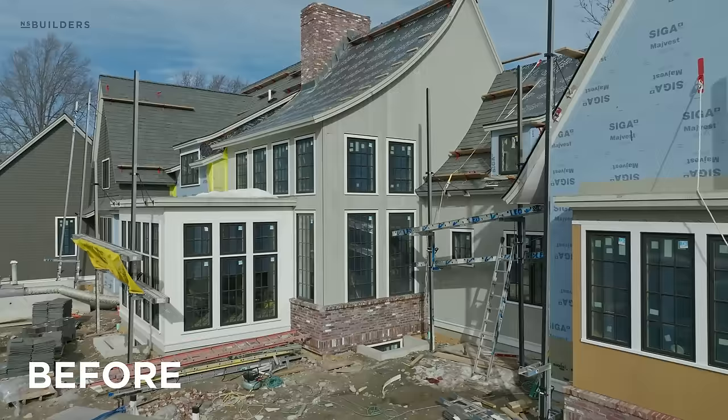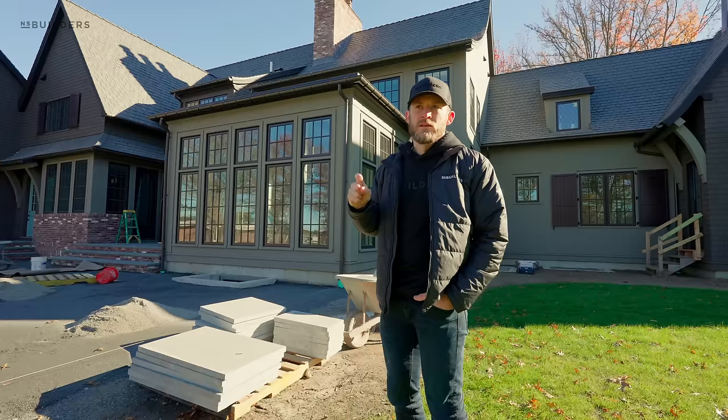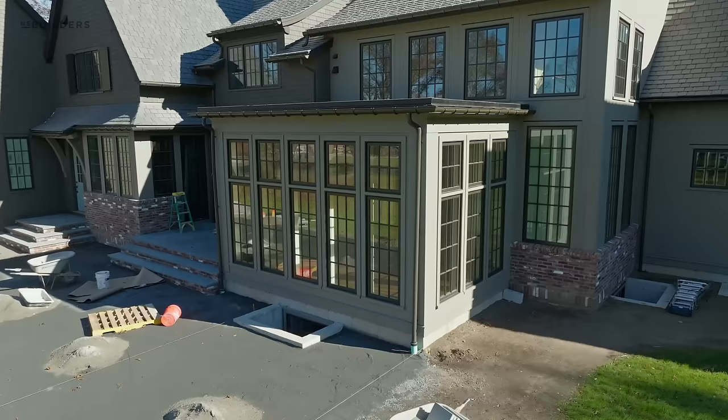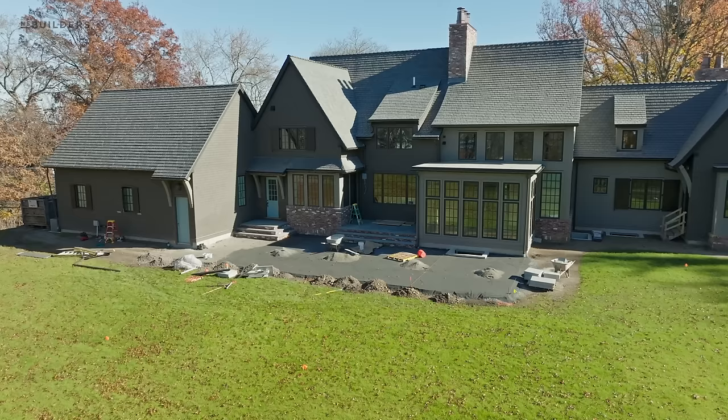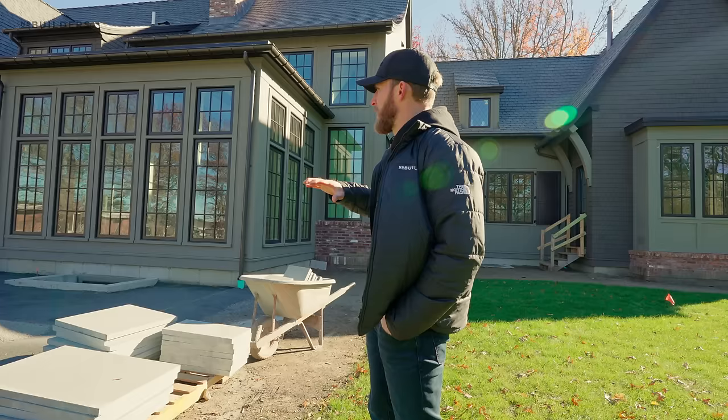This back dining room was actually clad in PVC. We had done that prior to knowing what the exterior trim color was going to be. When we painted it this dark gray, number one, the paint was not designed for PVC especially when it comes to expansion and contraction; number two, we had failure — some pretty substantial failure on the large pieces. Ultimately the team decided to strip it and redo it, and we've used the Duration True Exterior product on this entire exterior and got that all redone.